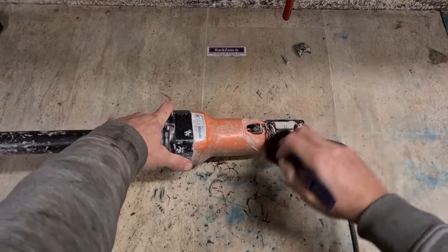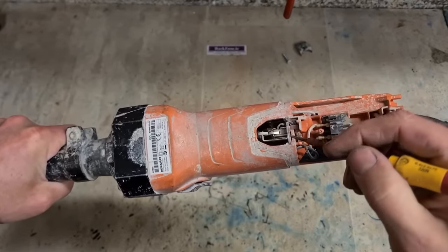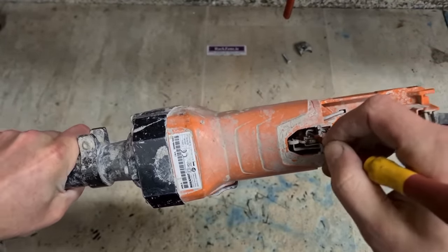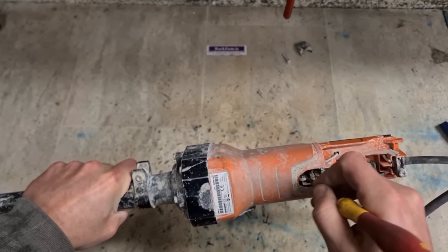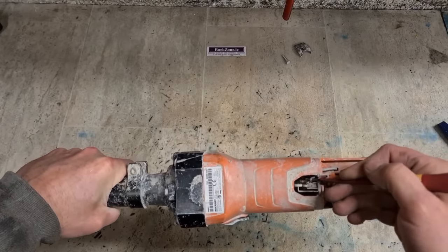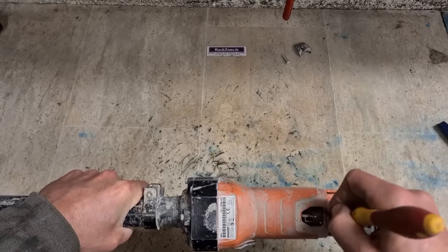Just get off the loose stuff here first. See how the moisture gets on and causes trouble. See that lead? See how stiff it is. That's starting to corrode a little bit. There's copper in them leads. They start to turn a wee greenish tinge. Lead starts to become very stiff. Brush is still working on the holder, mind you. That's not stiff. Just free that up a wee bit just in case it holds back the brush.